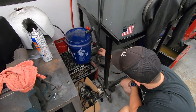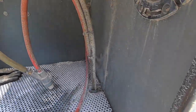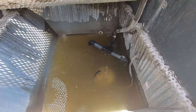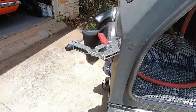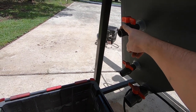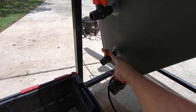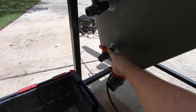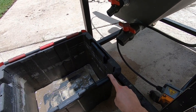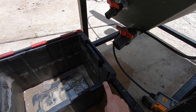Once we get it outside, I can tell you about these different valves and how we're going to use them to clean this thing out. Got everything out in the driveway — you can see now in the sun just how gross this thing is. Under here is the water reservoir with the pump. This generally goes in three steps: the top valve gets water down to its normal level. The next one down gets about 90% of the water out of the system. The very bottom one is the bigger one for getting all of the media out. I'm going to try and capture as much of it in a container as I can — I don't really want all that glass bead around my driveway and in my grass.